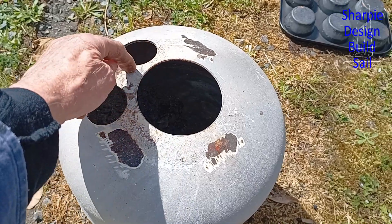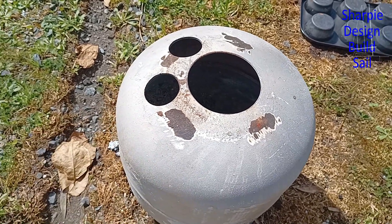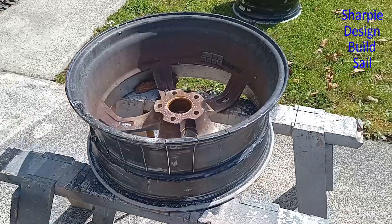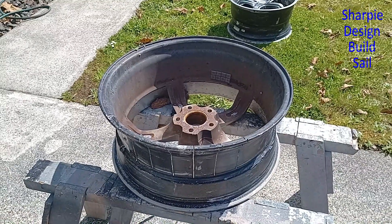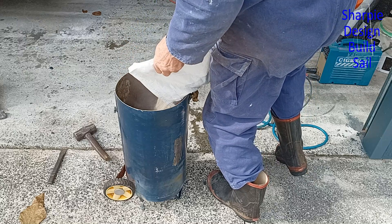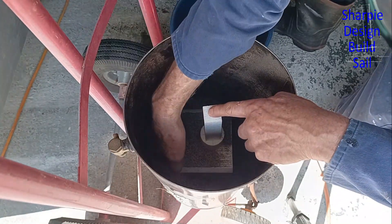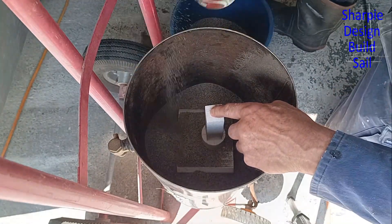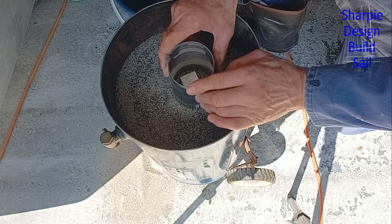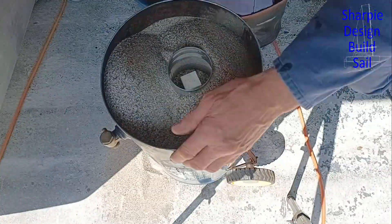I was thinking of blocking these holes and putting little v's here around the edge so that the flame had to go up past the crucible, not go out the holes without adding the last bit of heat into it. I've got three kgs of ingots ready to go. I expect that I'll need about halfway down of this wheel. I'm going to use less than four by my calculations. I've got some pool filter sand — I might need to get another bag, we'll see when we tip it in.